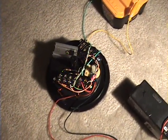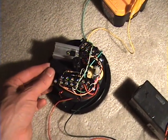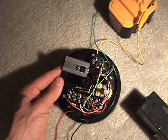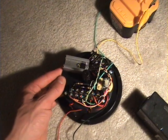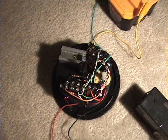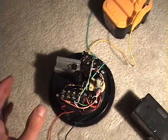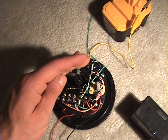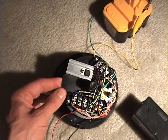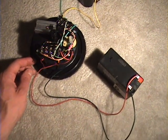It's an air core. The air core gives you the most efficiency with the solid state design. With an iron core, you just have losses because of the iron. Since there's no mechanical wheel, you're not looking for free mechanical motion with the iron being attracted to magnets on the wheel. The only reason you use an iron core is because you get free mechanical energy as the wheel comes around and is attracted to the iron core. On this, you don't need an iron core, and it actually harms performance if you use one. So for a solid state design, you want to use an air core.